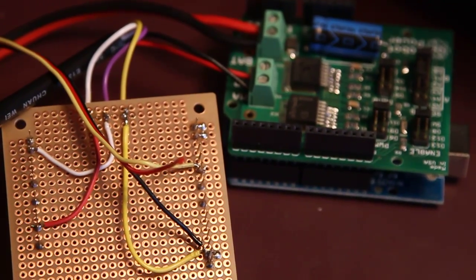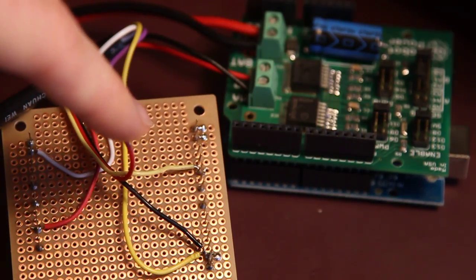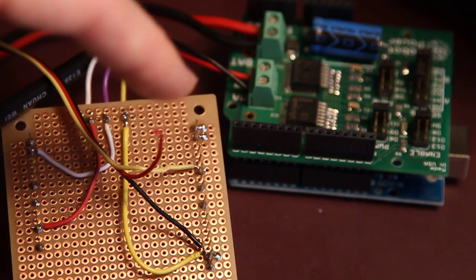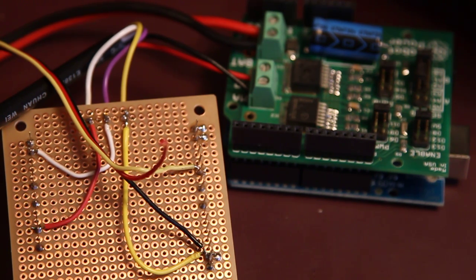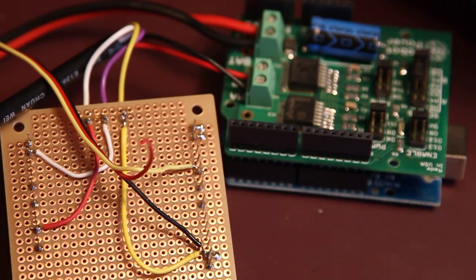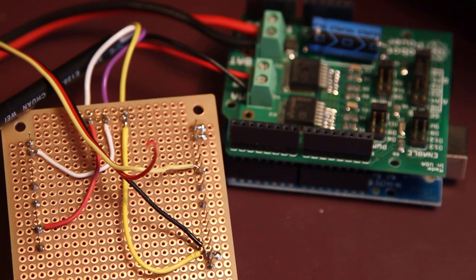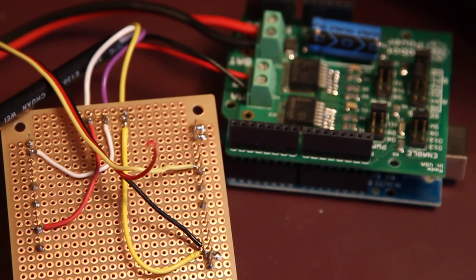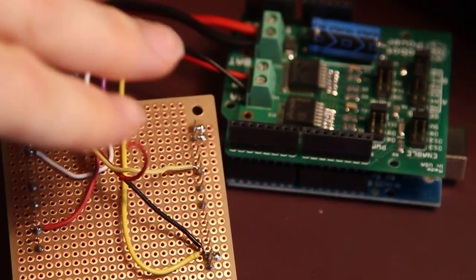Here's the wiring on the Adafruit DIY shield. This wire is running into the receiver. The red wire is not connected — that's a voltage wire that can send voltage into the receiver. If the receiver didn't have its own battery pack, you could plug that into positive five volts if the electronics ran off five volts and didn't use too many milliamps. I decided the receiver is more reliable powered with its own six-volt pack, so this power wire is not connected.